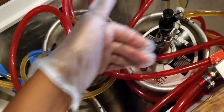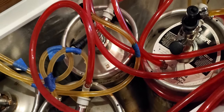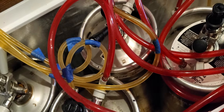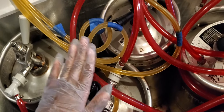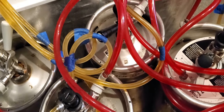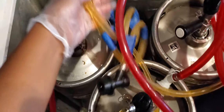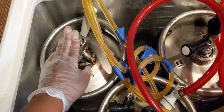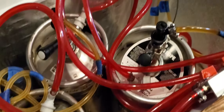I'm going to pull these off and keep them inside so I know which is which. At this point it wouldn't really matter since you're cleaning all the lines. The reason I want to keep these where they are is because we already have tags on them and the bartenders are already used to where a certain beer is — I don't want to confuse anyone. But if you're running this yourself, try to keep these lines close to where the beer is. Always when you're cleaning, disengage. Alright, now let's clean.